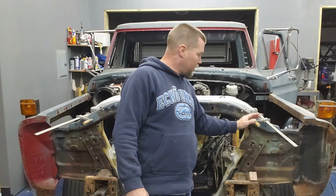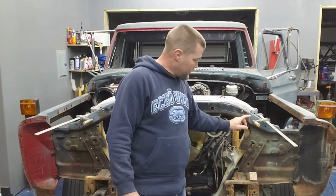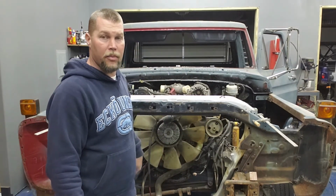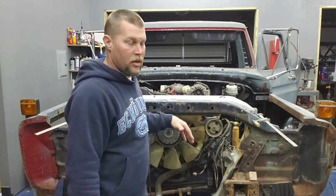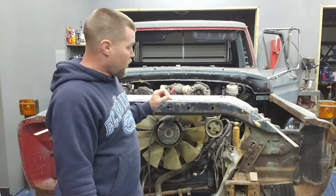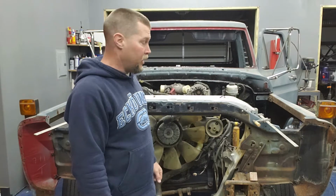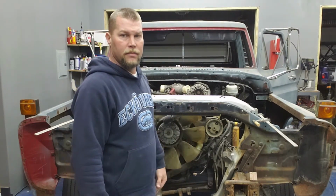I'm making a nice line right here, a nice clean line that opens me up to the bolts on this 2000 model radiator support. And I'll cut this '77 radiator support. I'll cut this main beam off of it because it'll be held in place by my two aprons. That'll be welded in place. Then I'll be able to take it out, finish working it in from the front and the back from there. I make some brackets and everything. When it comes time, I'll show you close-ups on all that, everything that I have to do. So for now, my next move is flip this guy back, do some grinding, get it all cleaned up, and get ready to put it back together. Once I get it cleaned up, then I'll kind of show you what we're working with.